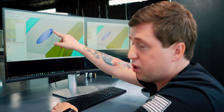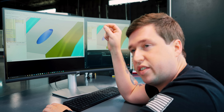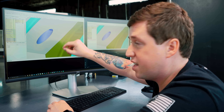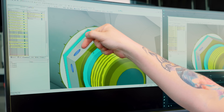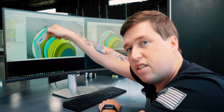So you can see right here the little bit of blue — that's all that's left from the stubby drill. The longer drill does the whole entire wire hole, but you need the stubby drill to guide it. You're gonna machine away everything the stubby drill does, and the long drill is gonna do the whole wire hole. But again, if you look at this hole — if you were to come in with a tinier end mill in something like Inconel, the tool would eventually get dull and deflect and break.